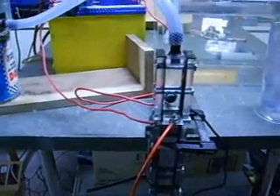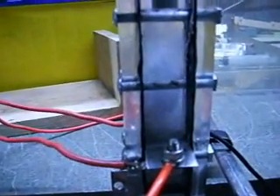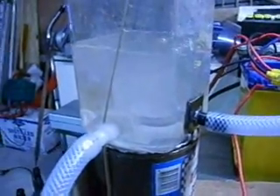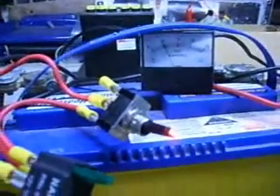Hello and welcome. This is a continuation of my last video and I have redone my piping system for this stick electrolyzer here. Right now it's wired up just to the two outer plates, so it's running five neutral plates. I've also got cables running down to the bottom of the same plates. I'm going to flick that on — I've already got some electrolyte in the water. Right now that's sitting on about four and a half amps.